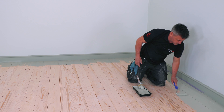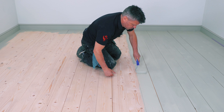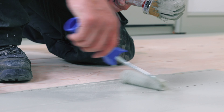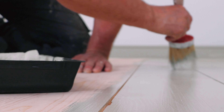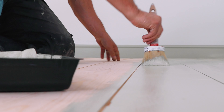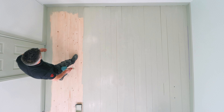I apply the paint onto the floorboards using a four-inch roller — it's a little small radiator roller with a foam head — and for me it's so much quicker and easier. I apply it on one of the planks, regardless of how thick or wide it is, then I take my large brush and feather across the paint I've just applied, so I get a nice, even, smooth finish.